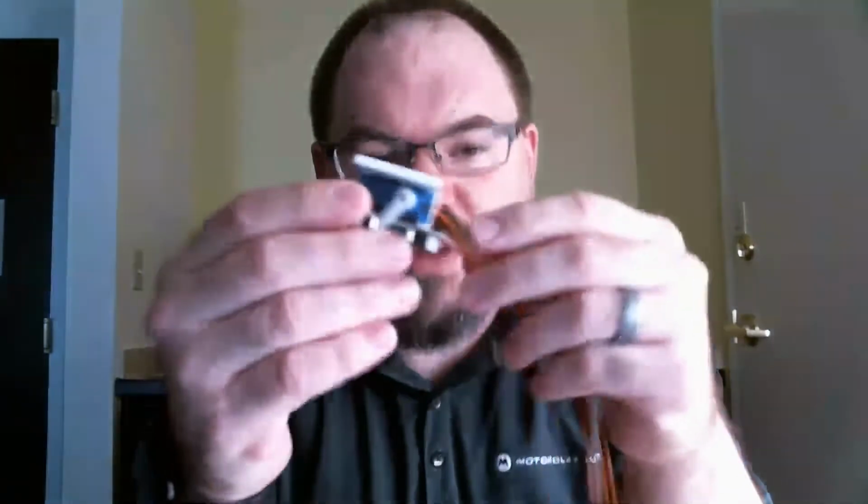Well, there's a number of commercial products out there that you can do this with. But in the last few years, especially, I've seen a lot of people getting very interested in using cheap hobby servos to do this. One of the common methods is to mount the motor from the bottom. Then there's an actuating arm, as you can see here, that goes up under the track and switches the track back and forth. Like I said, there's some commercial products out there that work really well. They're just a little expensive, especially if you're getting into more than 5, 10, 15, 20. There's some guys that have 100 plus on their layout. Of course, it's a pretty good size layout.